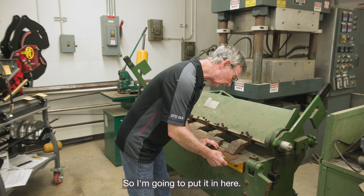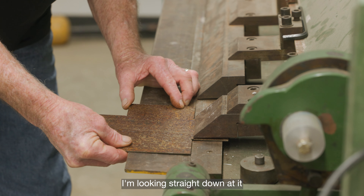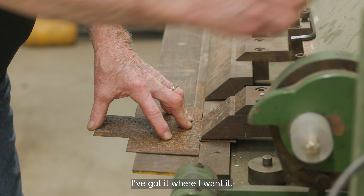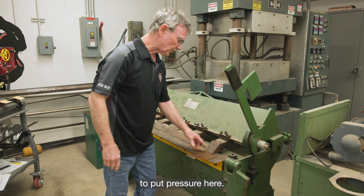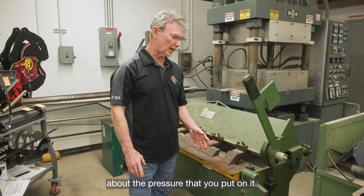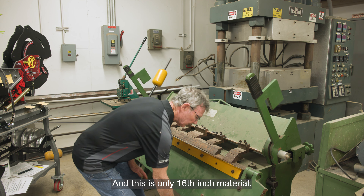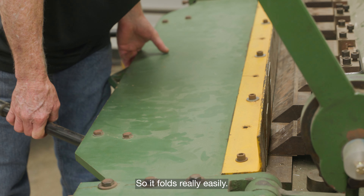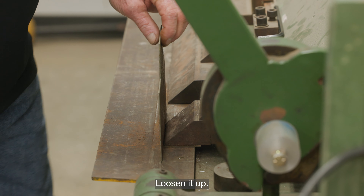I'm going to try and make that line appear just to the face of this surface and this surface — that's how I'm going to line this thing up. I'm looking straight down at it, and I've got it where I want it. I'm going to lock it down. It takes a little bit of pressure, but the folding is all about the pressure you put on it. If you don't get good pressure on it, it's not going to fold. This is only 16th inch material, so it folds really easily.